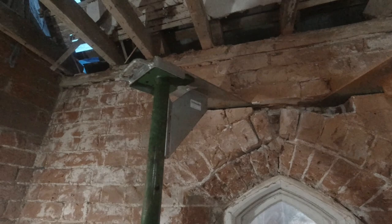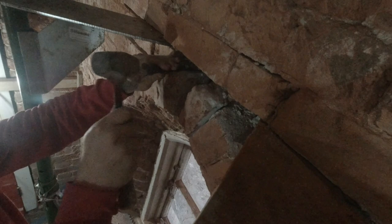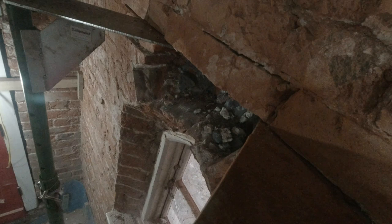We've got some strong boys set up there. We're going to start taking out some bricks and get this all exposed. What's happening is we're getting rid of the bricks above the window. The window's coming out and we're replacing it with a new PVC double glazed window. We're going to get all this stuff out, put in a nice steel lintel and then brick back over the top.